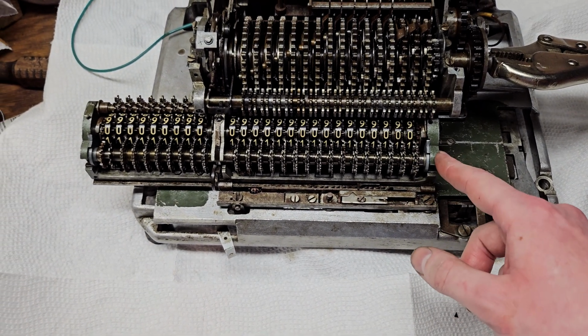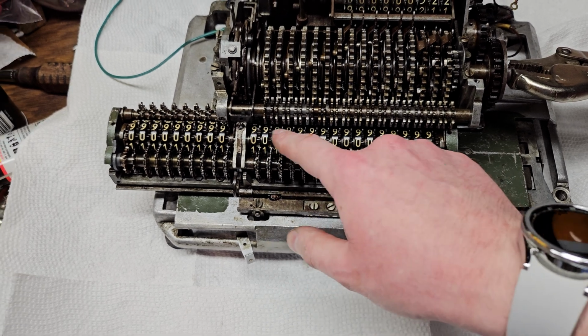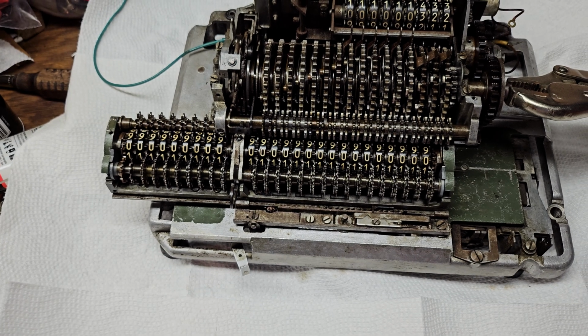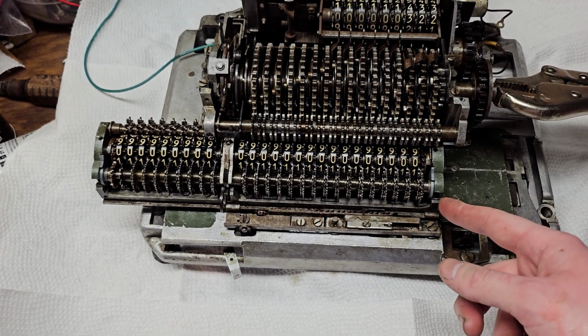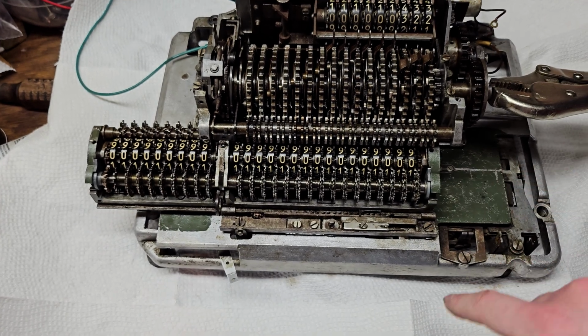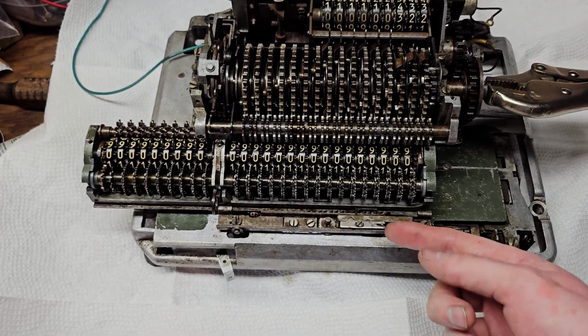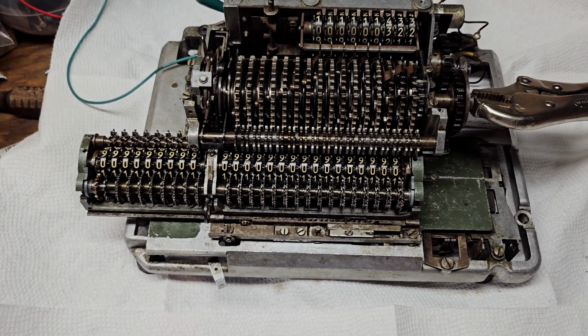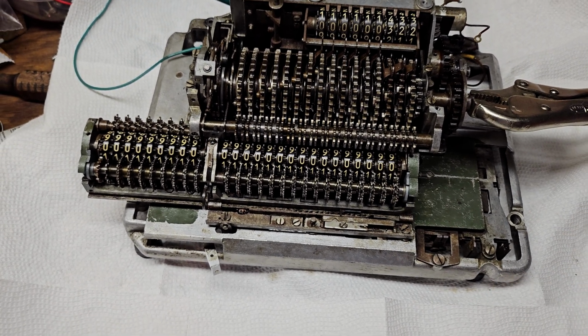So that's what's holding the carriage now, because those other main carriage ratchet racks have dropped down and are out of engagement, and the carriage is now sprung this way, which normally you can push the carriage that way anyway, but it's sprung that way, so there's a finger that comes up to stop it. As soon as I push this button, it will release that finger, and the machine will operate.